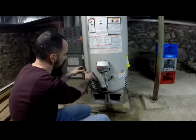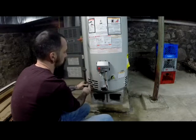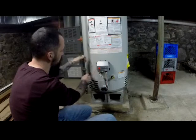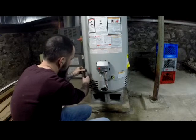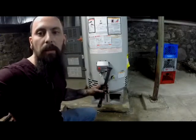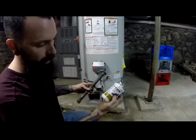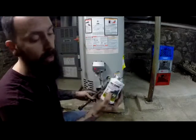This is the way you get it off, because if this piece is connected to here, then you can't turn this. It won't turn because this is on here. So you turn this instead, and that's how you get it off. Okay? So basically from there, you're just going to connect to here and make sure everything's tight. Now what you're going to do in here on the pipe that I'm missing, it's stuck on my old one. I can't even show you, it doesn't even matter. Okay, so you just take some joint compound for pipes. Make sure you buy the one that is for gas pipes.